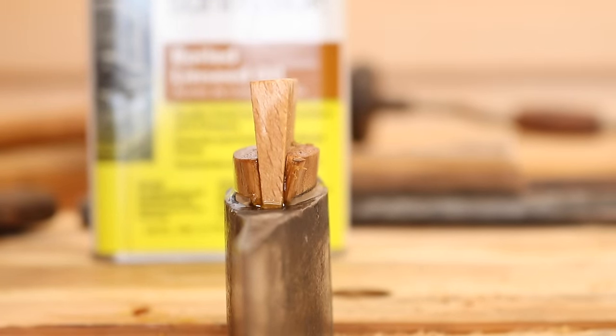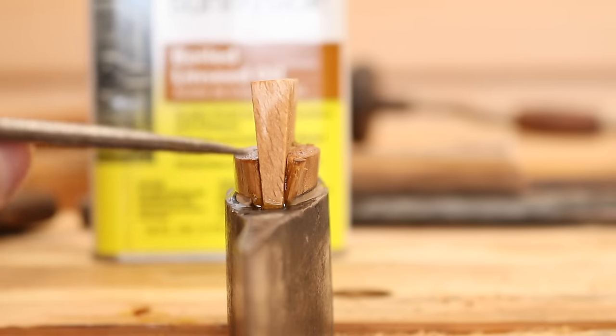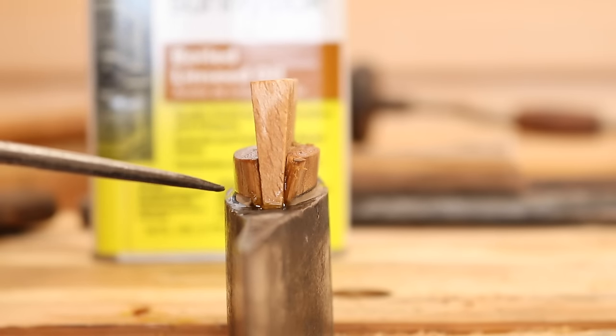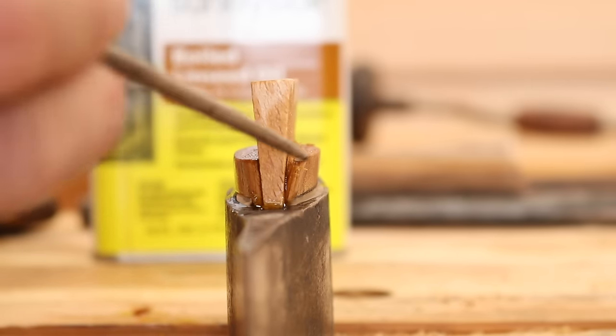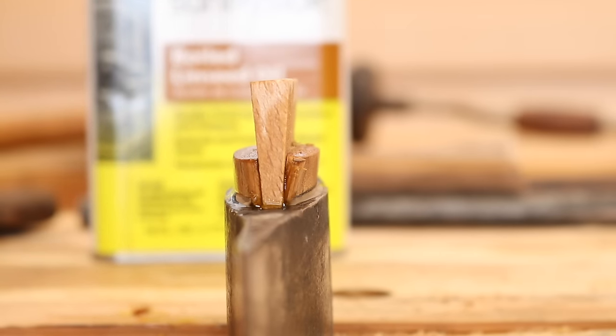The question is how far are you going — you've got to use some common sense there. It depends on how big your axe head is and how big the wood you're working with. You start to see that wedge is down there pretty good. It's starting to mushroom these sides out — see how they're sticking out like that. You can't ask for anything more than that. We're hard down on the cheeks on the bottoms, it can't go down any further. This is all mushroomed out at the top — we can't do any more there.